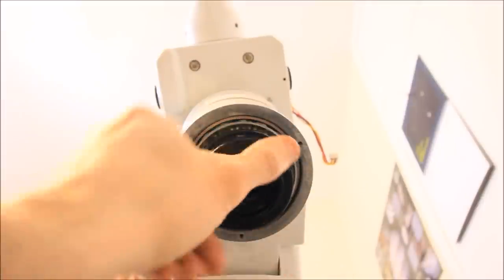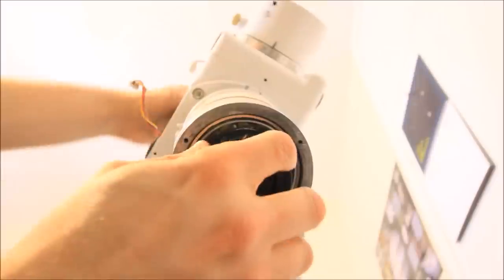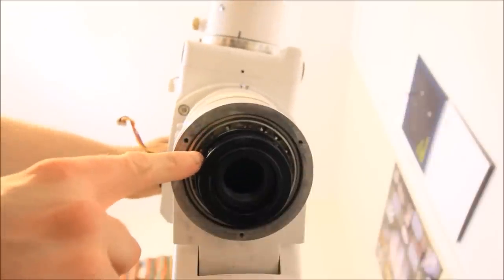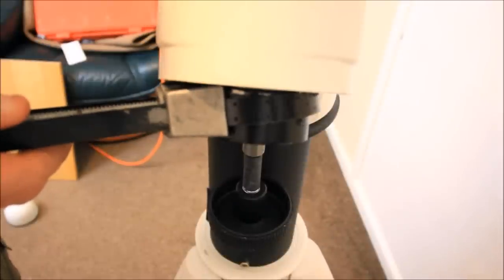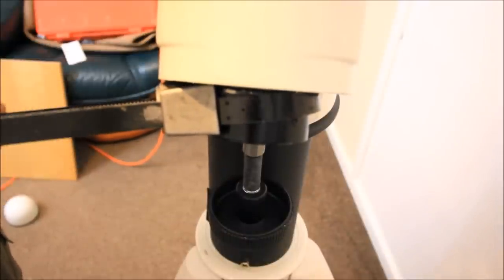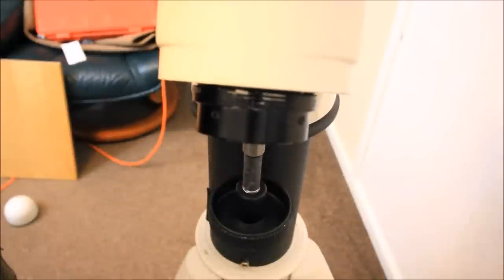And what we'll do is we're going to adjust the bearing. So we'll put it in by hand. Wow, that's ready to rotate. Okay, we're around about the tension there. There's no free play. So we're going to tighten up these screws. So once we've tightened up, we're just using a tool to preload it. Once it's tight, we just back it off slightly, like so. Just literally only a little bit of a turn, and that should be right.